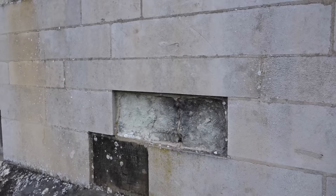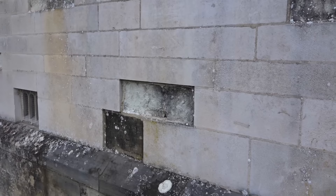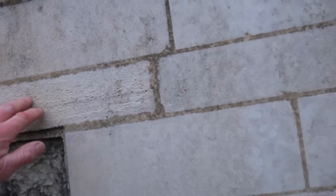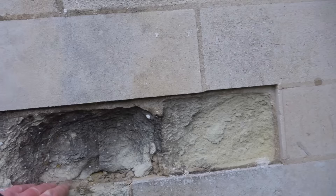I think that's what they were - they were kind of slips that they put on there. What they've done is taken some stone, cut it into thinner bits, and stuck those over the top of the stone to try and save it from the weather. But what's happened is the stone has spalled - it's lost adhesion, that's erosion from the weather. People would say you've trapped in the moisture and now it's the moisture that's pushing the stones off the blockwork - and that could be right. When you've got a building of this age it's a bit of a money pit, and fortunately the Church of England they've got a few bob - in fact they own quite a lot of property around here.